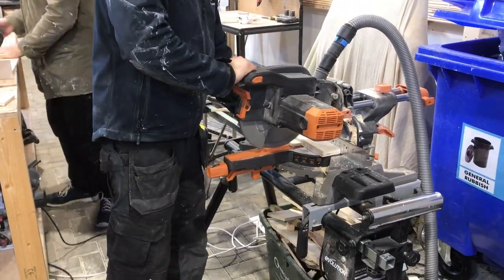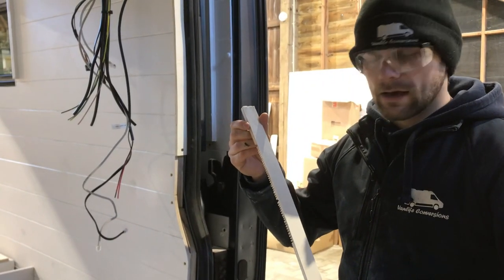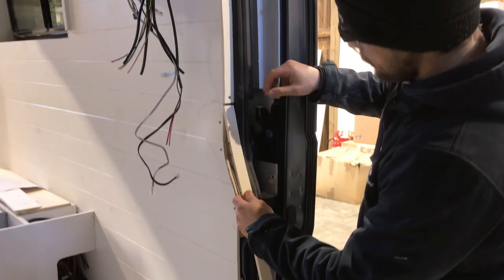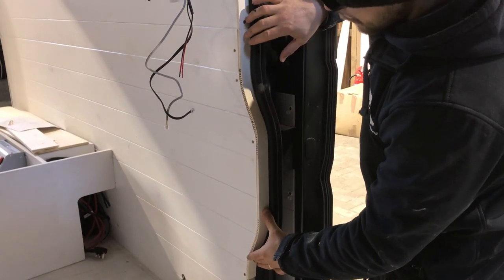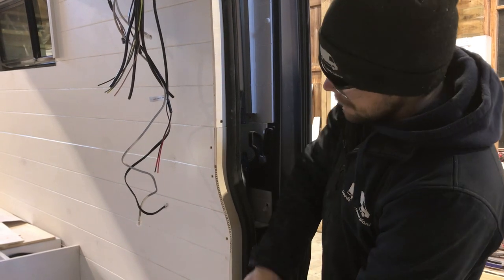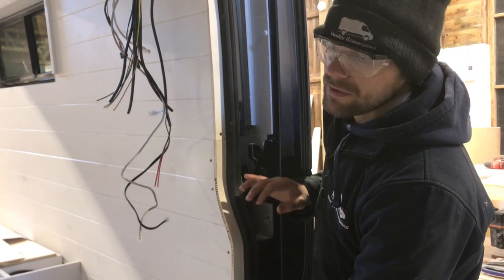Here's the piece I just kerf cut along with the chop saw — I'm now going to show you how it fits the shape of this profile. I ease the curve where the wall is going to be, rough screw it in, then sand it back flush. When it comes to fitting it once it's been painted, we'll put filler in the holes down the side, glue it to the end grain of the plywood, and put brad nails in to hold it nice and secure. Really happy with how this is looking — it's covering the end grain of the walls at the kitchen unit end.